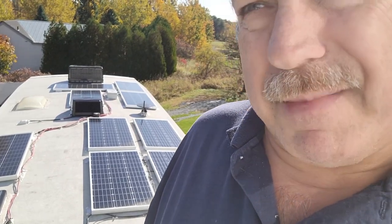So that's this year's solar project: six more panels, the combiner box, the DC-DC charger, wires and connectors to the truck, and the Bluetooth connection. Now we're running a thousand watts of solar and 340 amp hours of lithium batteries. I might want to add one more battery someday — we'll see how it goes — but we're very pleased with this setup. The trailer sits here in the driveway unplugged, inverter on, and we can come out and watch TV or do whatever we want with plenty of power.